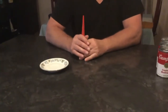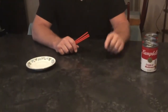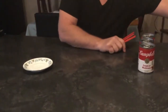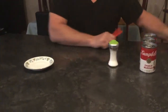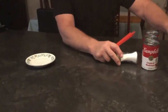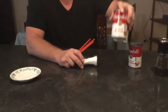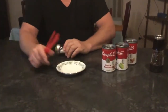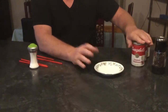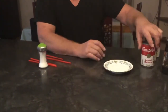I was going to tell you about when you should correctly use the endo-pipe laser compared to when you use the above-ground spinning laser. We'll just simulate this — the salt shaker is the endo-pipe laser, and this will simulate the above-ground. These will be manhole sections, and this will be a base. We'll assume I'm talking about storm sewer or sanitary sewer that has a base, but it works with a monolith too.